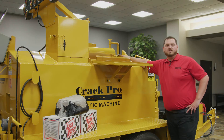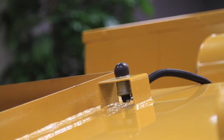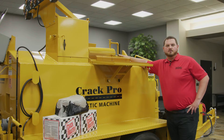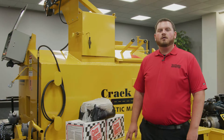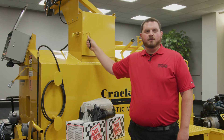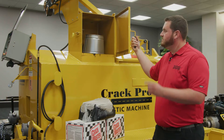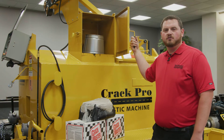Another key feature is our safety switch so that when you open the door, material is not able to be splashed out. This actually deactivates the agitator so that no one gets hurt while loading material. Located to the left side of the loading hatch is a pail warmer that you can insert a metal pail into for touch-up work and also cleaning out your gate on the back of the machine. It recycles the material back in so that there's no material waste.